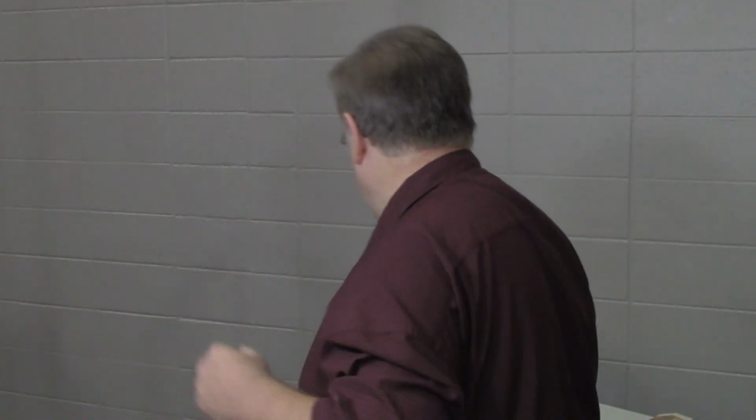Now, I do want to say I'm glad that you brought that up because it made me think. I've heard a few people say, who have been turning longer than me, that you can turn a peppermill with semi-green wood, with something that's not really dry yet, but the outside's dry. I disagree. If it's wet on the inside and dry on the outside, it is going to move. It's going to split. It might not split, but it can move. And let me show you what will happen. Imagine this. Now, this was dry, obviously, and it wasn't cheap.